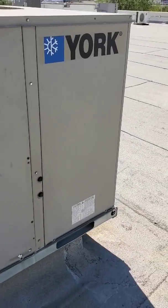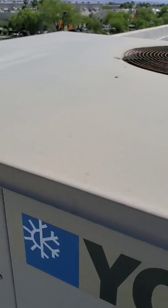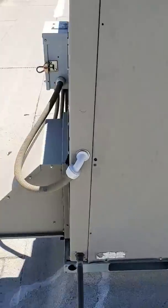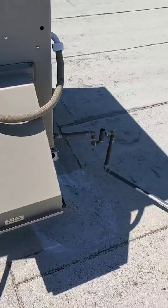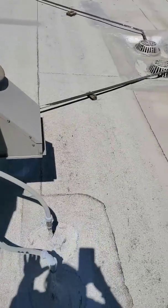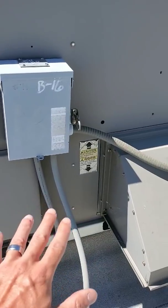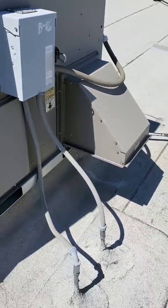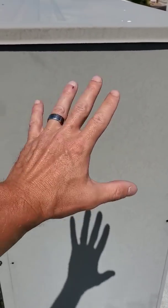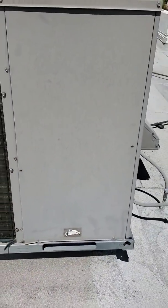It's just little things that'll help you so you don't miss anything. The main things are taking amp readings on your condenser fan and your indoor blower that's inside, checking your filters, and making sure that if they have outside dampers like this, they're not open all the way or closed all the way. Then make sure you take your temperature with temperature probes and get close to a 20-degree split - 20 to 22 degrees will be alright. When you go through all the electrical parts, just make sure your contactors are good, nothing is pitted or burnt, wires are not burnt up, and check your caps - your run caps, your dual caps, whatever it has.